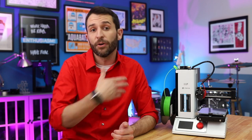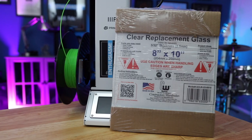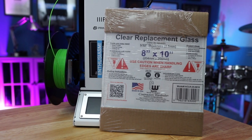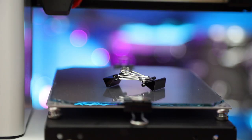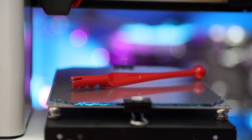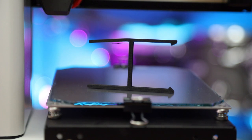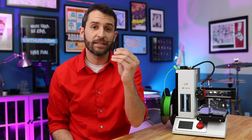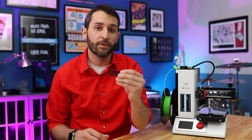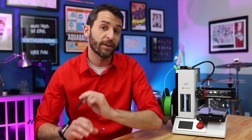So I've been printing on glass with this printer for over a year, and I've had great results with it. To install a glass bed, you only need a few things. You need an 8x10 piece of replacement clear glass — I got this one at Home Depot for about $1.50. You need two regular binder clips. You need a glass cutter, which I also got at Home Depot for about $3. You need to print a Z-axis spacer for the Select Mini — I'll link to the Thingiverse file for this print below. Since the glass changes the height of the bed, this clips on the Z-axis to accommodate that and make up for it. This print is super easy to install; it doesn't require any disassembly or parts — it just clips right in very easily.